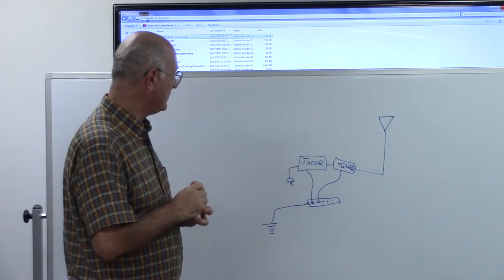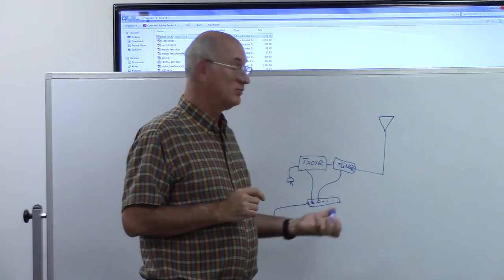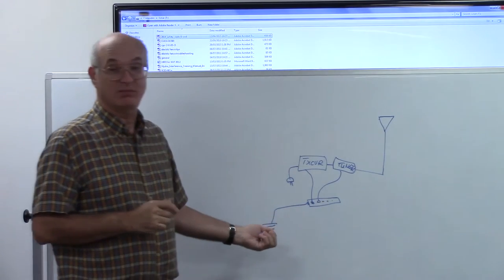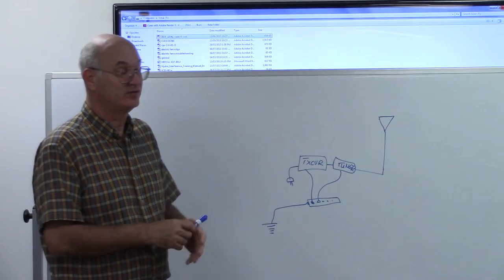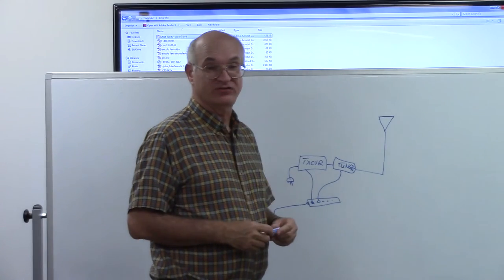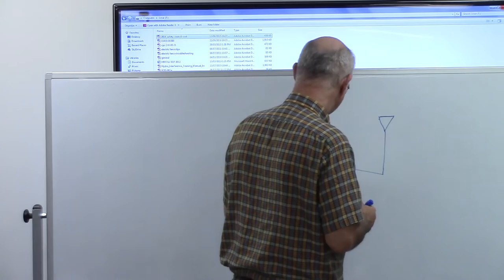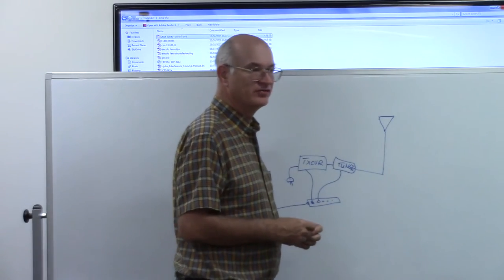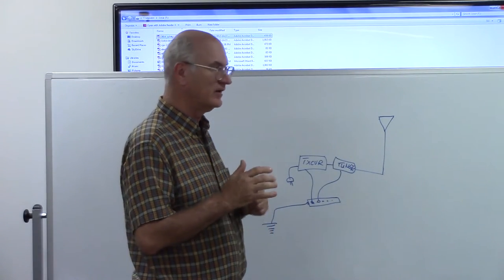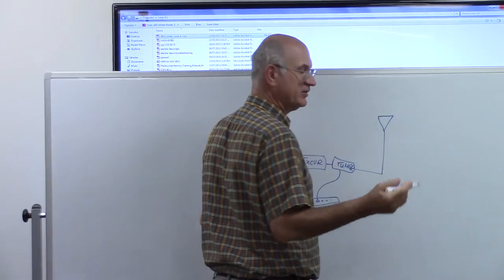That said, you don't have to have a station ground. They'll work without a station ground. But whenever you can, it's a good idea to put it in, because it can save you problems later. Particularly important for lightning strikes. To ground your equipment can save you a few thousand dollars in a lightning strike. Of course, the best protection is, when it's thunder and lightning out,